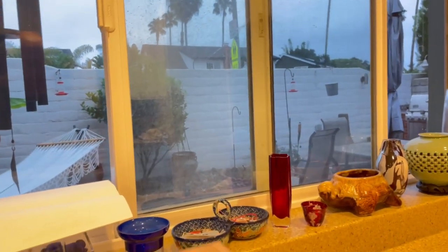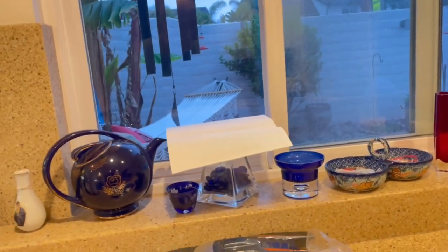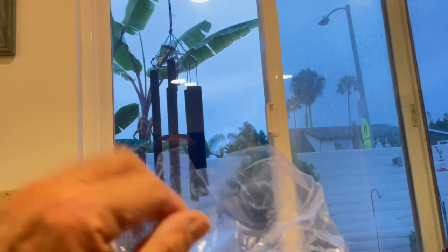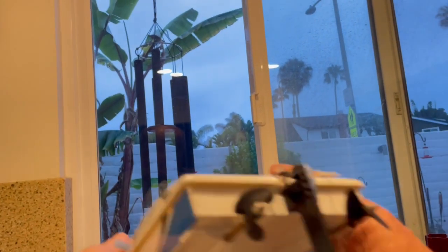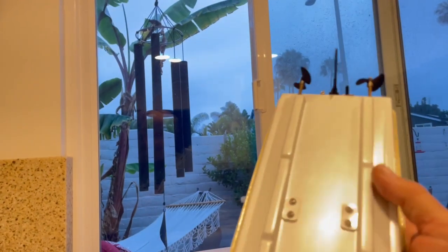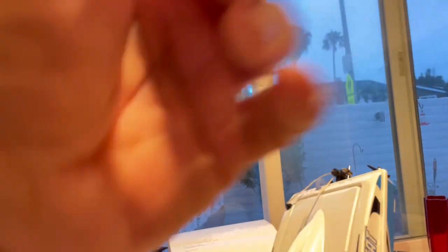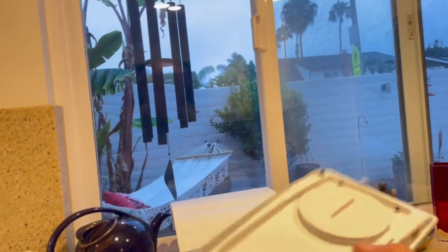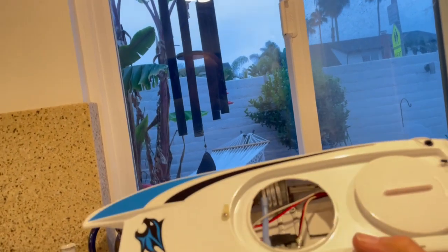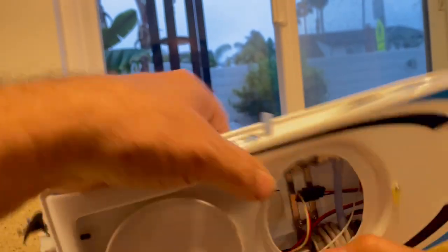Get a load of this - it's roughly the same size as that. Now, this is an interesting little boat. It was made back when Aquacraft was just starting to get a little performance. It's dual motors - they go the same direction, not counter-rotating. You see these bolts here? There are sub-hatches that rotate 45 degrees. It has two Speed 400 motors on a metal plate that bolts right in here with some doublers and such.